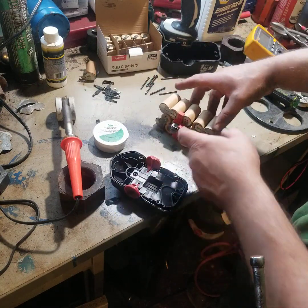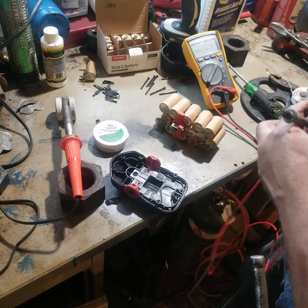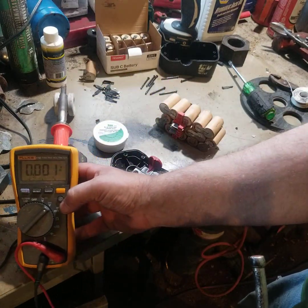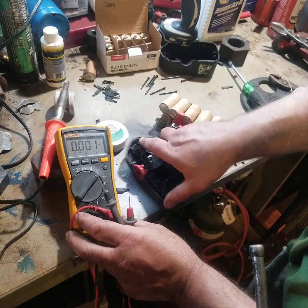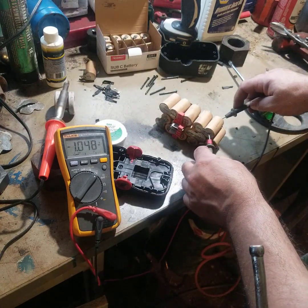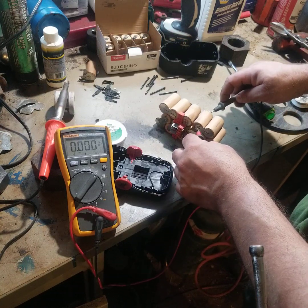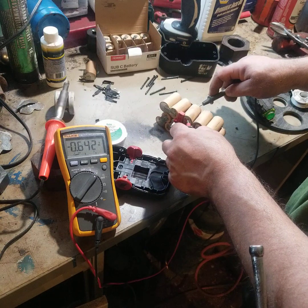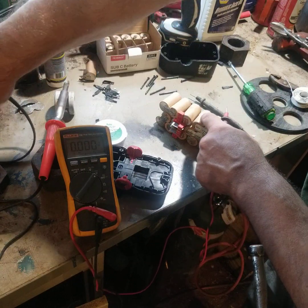You can test these individually because they're not making a loop here. Right about there - okay, so I can test each individual battery cell. It should be about 1.3 volts when they're good. The reading is showing about 1.1 on this one - sounds like junk. Whichever one was bad, I'll get a little magic marker and write 'bad' on it.